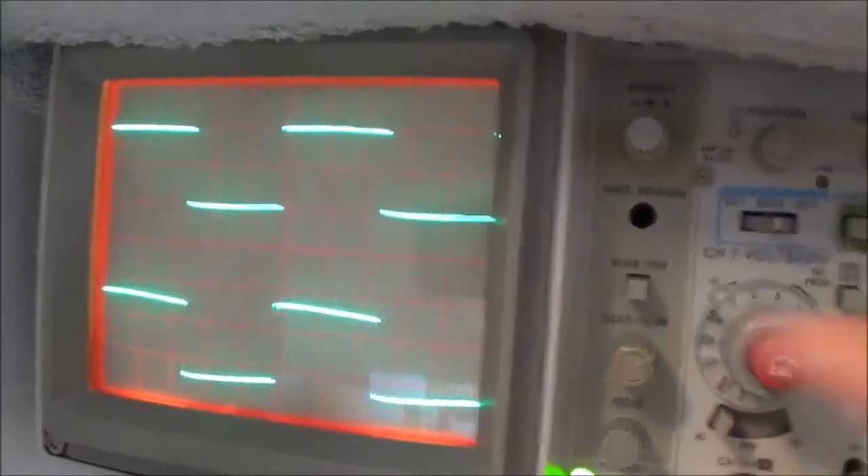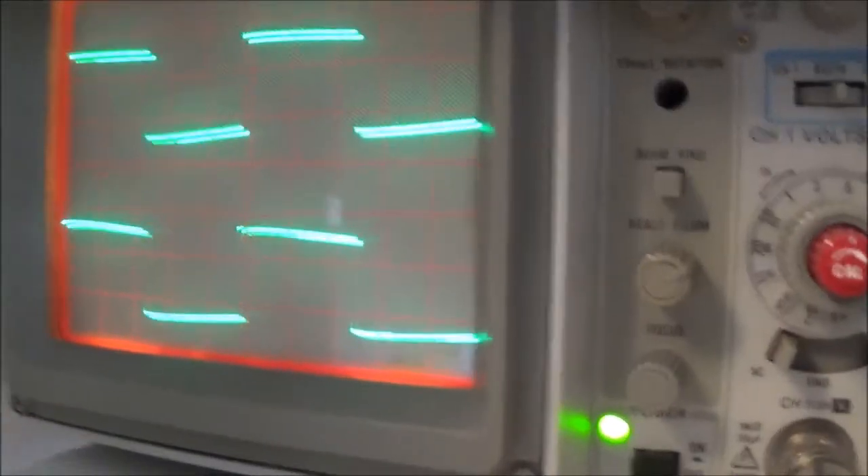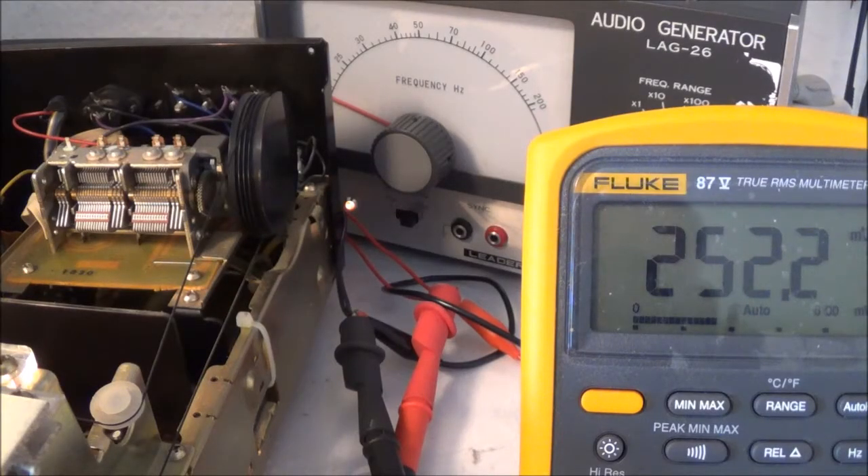If you leave it in AC coupling, you can see the tilt that appears right away, which would throw off your results — it gets even worse as you go lower in frequency. Now, feeding in a 200Hz square wave is going to cover all the way from 20Hz to 2000Hz. Then if I feed in a 2000Hz square wave, that's going to cover from 200Hz all the way up to 20,000Hz, which covers basically the full audio spectrum audible to the human ear.